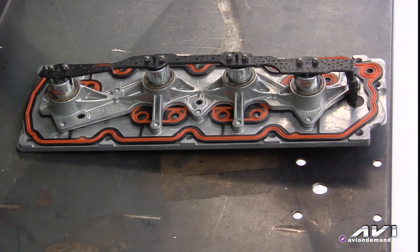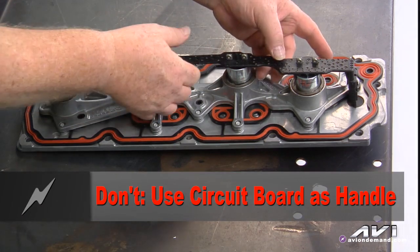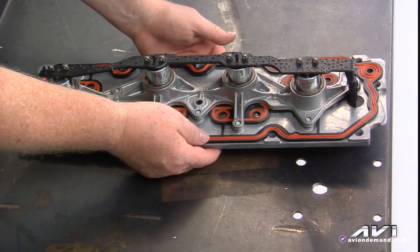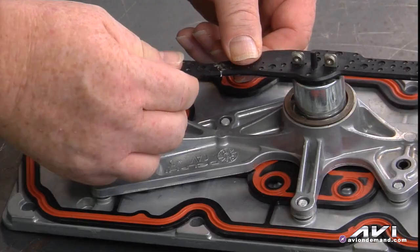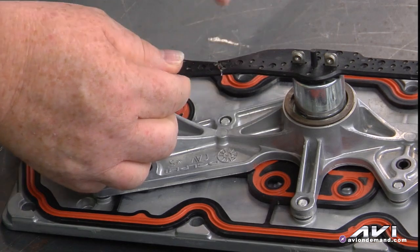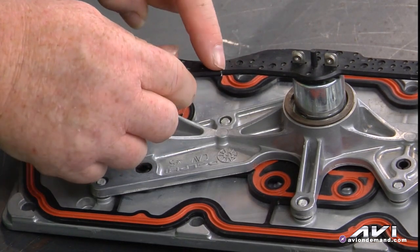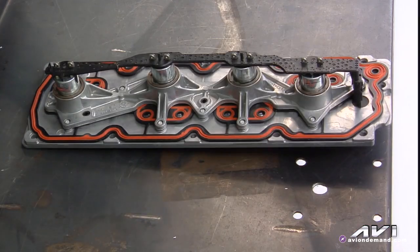Now what can happen if you're not careful? Here's the do's and don'ts. Don't pick the unit up by the circuit board — it looks like it's a handy little handle to pick the thing up, but don't do that. Always pick up the unit by the body, because if you pick it up by the circuit board, watch what happens — crack. The weight of the unit can break that circuit board. It could just be cracked and the connections are almost ready to come loose, and you have higher than normal resistance or open resistance — infinity, OL — on your meter, and that's telling you somebody possibly has broken this.